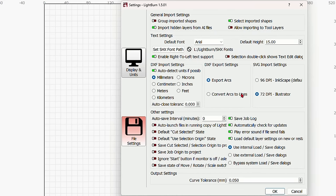Now I've just turned that on, and as you can see, it is not homing. So I will show you the reason for that, because this is going to be a problem that some of you may have. You'll see that it still says disconnected. There are two things I can do here. I can either right-click this devices button, or the easier way is to pull this down and choose the right COM port.